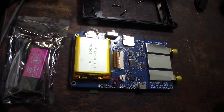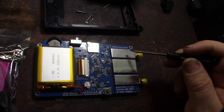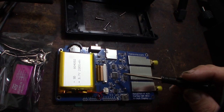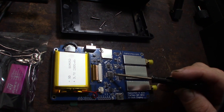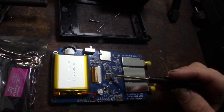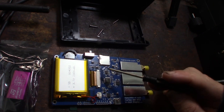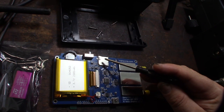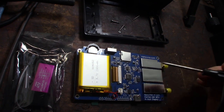So I guess I'm wrong. I guess there's only one ARM processor that controls the LCD function and the actual antenna logic. So I wonder if they're actually running a bootloader on this thing. Because the only firmware upgrade videos I watched say to put the CPU into DFU mode and it flashes directly. But with a bootloader, you can tell the ARM processor to pick up a firmware file from the SD card. Like in the 3D printing world, you could upload a file called firmware.bin, and as soon as it boots up, it looks at the SD card and pulls the firmware down. But, all right, so it's a lithium battery.